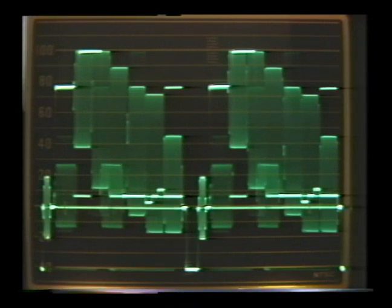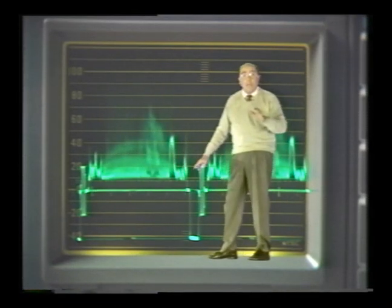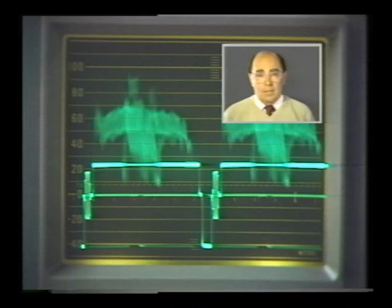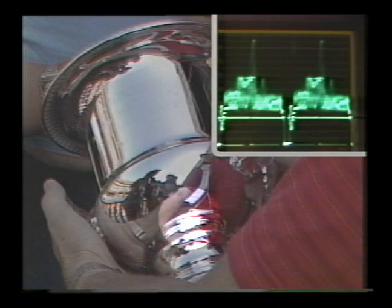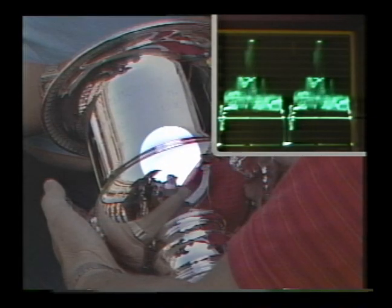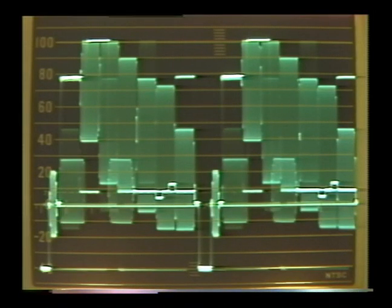With this video, we'll use the vertical markings on the graticule. We already said the black level should be at seven and a half IRE; the brightest part of the picture should not exceed the 100 IRE mark. If the picture is too hot or bright, the display will look like this, and if the picture is dark, the waveform will look like this. The waveform monitor is to a television director what a light meter is to a photographer — with it we can make sure we have the correct amount of light on each scene. Setting the levels is easy: simply adjust the levels with the controls at your video source until they fall within the 100 IRE and the seven and a half IRE range. The color bar test signal provides a quick reference to check the operation of your television system.